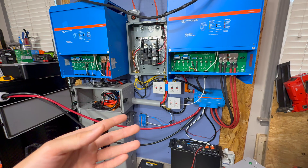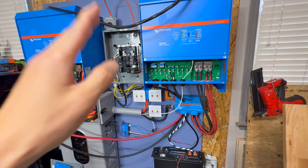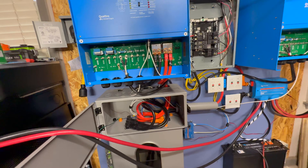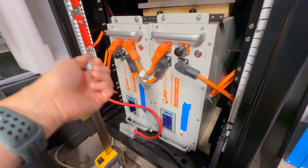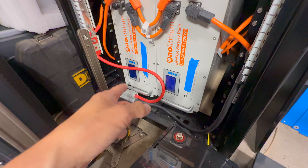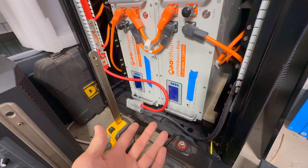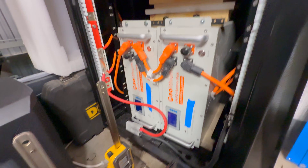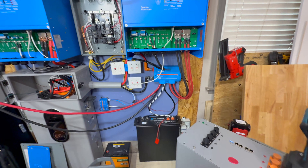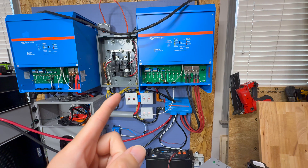For loads within the range it's designed for, this system works perfectly fine. The Victron Quattros work really, really nicely — I can't explain how nice they are to use. If you don't want to deal with all this wiring and hackery, just put Anderson quick connects on there and you'll be fine. Make sure you get quality, genuine connectors and good cables — this 4-gauge cable is connected so you can quick-connect a charge inverter at 100 amps continuous, and 4-gauge is perfectly fine for that. Hopefully sometime soon we'll get the second battery connected and everything cleaned up. Thanks for watching, have a good day!